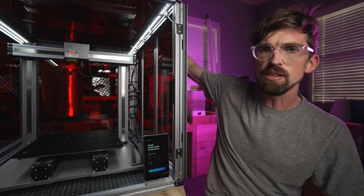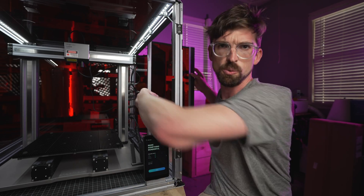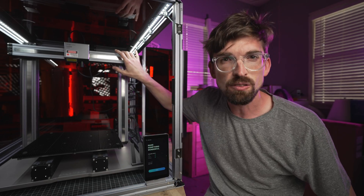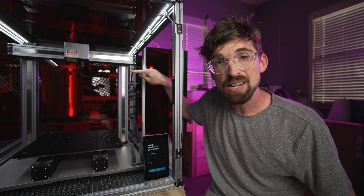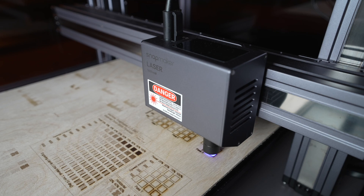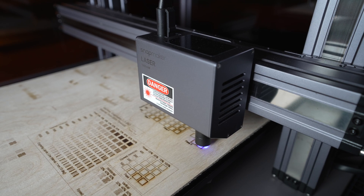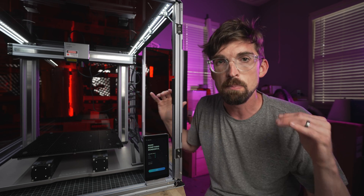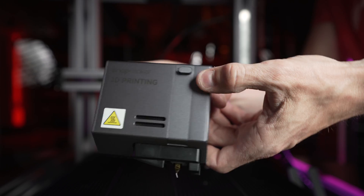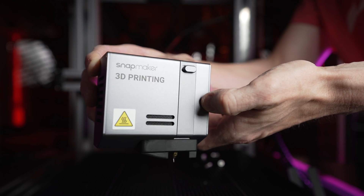Since the 2.0 released, they've made several more big improvements to the machine — mainly the power module, which is much quieter than before. The linear rails now have larger rods inside, going from 8 millimeters up to 20 millimeters, enclosed in a metal ribbon so CNC dust doesn't gunk up the screws. They also upped the stepper motor chip to the TMC 2209, which is much quieter, so noise won't be as much of an issue when running this as a laser or a 3D printer.